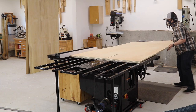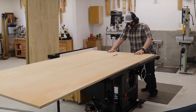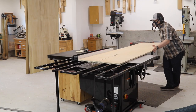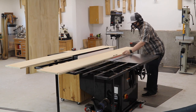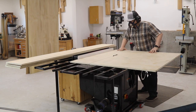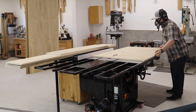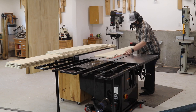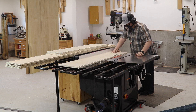I started by breaking down a larger 4x8 sheet with a cut at 27 inches, which allows me to more easily rip three pieces down to 13 inches wide. After ripping those three pieces, I moved on to another piece of plywood I have sitting around — a roughly 4x4 piece — and ripped it to 13 inches wide. The last piece I cut to 13 inches but it's going to be a shelf on the wider side, cut at 12 and a quarter inches wide.